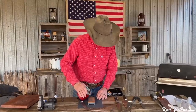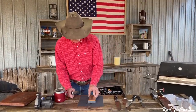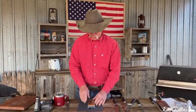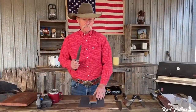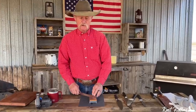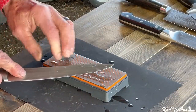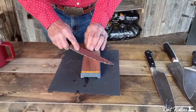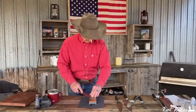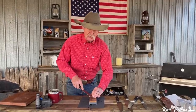Let's have a little bit of water — or you can use oil — but we need a little lubricant on there of some kind. When you start with this, it ain't sliding on that sandpaper, so if you've got one of them good rubber mats you can put down here, slap that on it to where it don't move, because you need to be able to create a little pressure. So if we're going to sharpen, it's diagonal — going about four o'clock. If this is 12, this is pretty close to four, right along in here. You're starting here, and as you work down, the blade sticks out farther as it gets to that end. That way, this blade is not bending up or down either way.